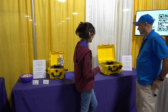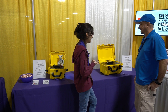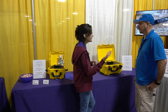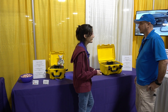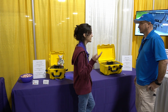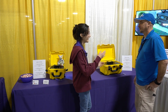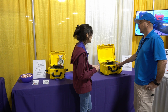I really like this solar charge controller — it's the Buddipole Power Mini. If you're not familiar with it I would definitely check it out, especially those of you looking for solar capabilities, because this will allow you to see how much battery you have, how much you've drawn down, how much you've put in with solar. It allows you to make smart decisions — if you're out in an emergency or on a DX-pedition and the bands are dead and you don't have much sun, you can take a break, let the battery recover, and come back when conditions improve. That way your battery lasts longer.